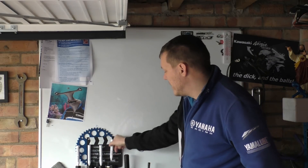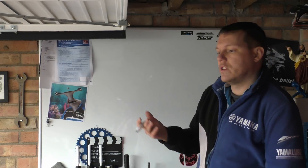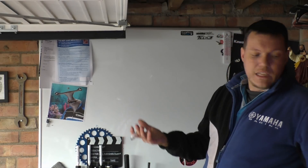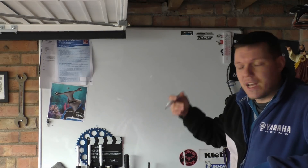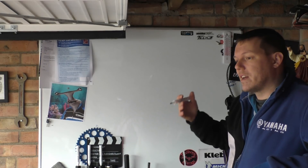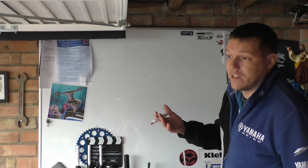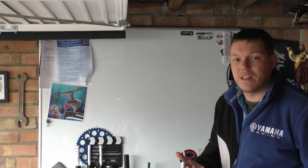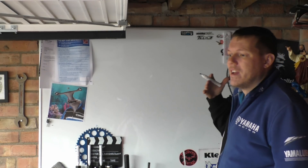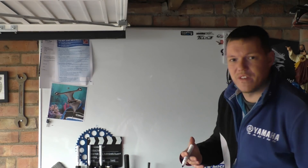When you want to get rid of something you use abrasion — you use something like aluminium oxide, zirconias, stuff like that. Basically these are just very hard crystals. Aluminium oxide on most sandpapers is just a crystal of aluminium oxide, very very hard stuff, and it's basically just which one wins in a friction fight.